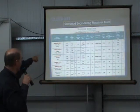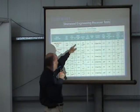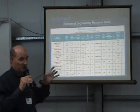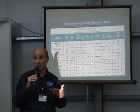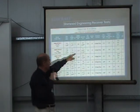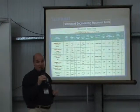If you look there, the KX3 gets 138 dB of 100 kilohertz blocking dynamic range. So signals even 100 kilohertz or 10 kilohertz away, it doesn't matter in our case because we have tight roofing filters. You have to have them 138 dB above the noise floor before they cause that to happen. If you look at an FT5000, which is a very good radio, which is still not a bad number, they're 127, so they're 11 to 13 dB worse.